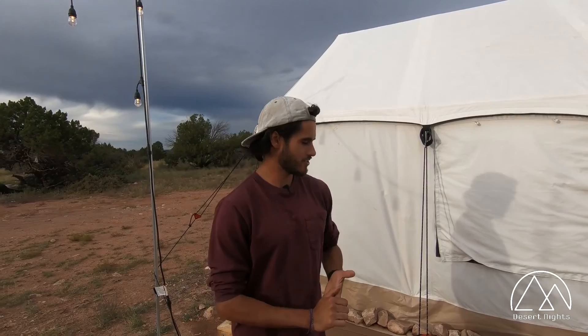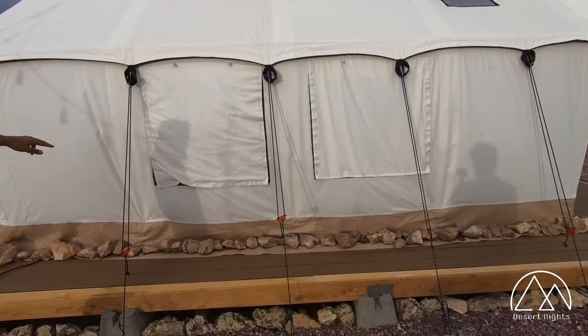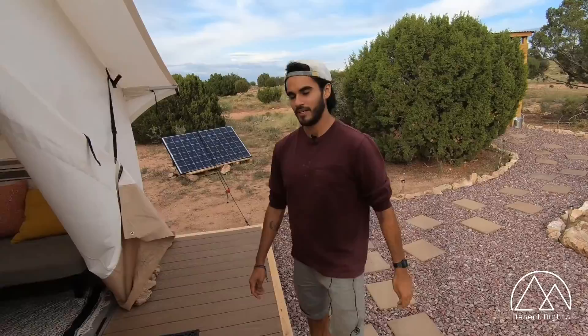Now I'm going to touch a little bit on the deck design. We went with these concrete footers that don't need to be embedded in the ground at all — you just rest them on top of the dirt and level them all out. For the frame, it's entirely made out of two-by-sixes. The deck is 20 feet by 16 feet wide. The outside area is lined with composite deck boards, just like our previous deck, but on the inside we've got real vinyl flooring, which gives it a more homey vibe.